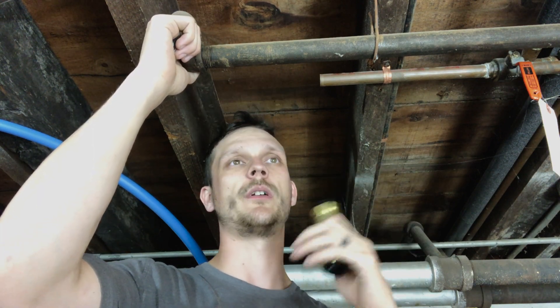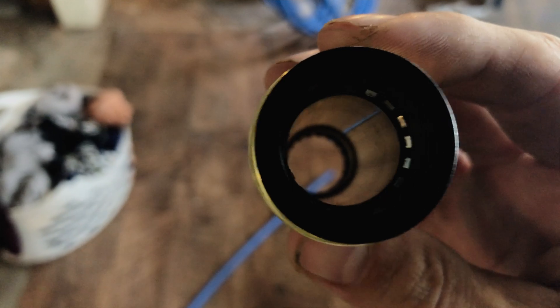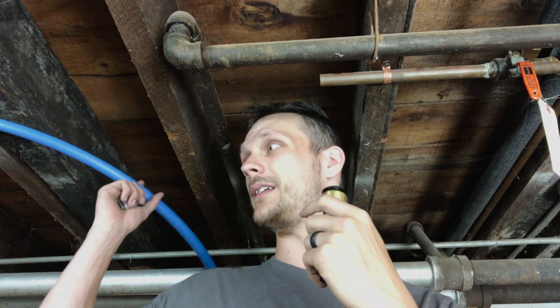You're usually going to have a couple of parts that come with it. One of these is an inside cap that needs to get slipped inside of the PEX tubing. This ensures that the PEX stays solid enough so that when the teeth come over it, it doesn't shrink or bend — it ensures you get a good fit. There is a bit of debate out there about the longevity of these types of fittings. They're awesome because they're fast, but they are more expensive. If you were re-plumbing a whole house or a remodel where you're going to cover it up, I would almost always use crimp fittings instead. The reason is there's a little rubber grommet inside that's what's actually making the watertight seal. These are great for connecting different pipe types — copper to PVC, CPVC, or PEX — but I wouldn't use them in an application where you're going to be covering the walls up.